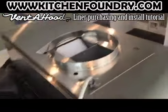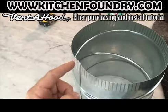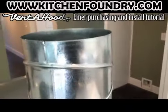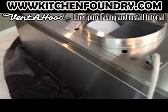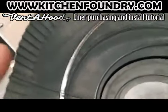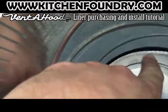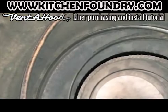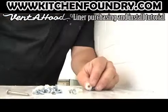After the hood's installed, one thing we don't want to do is put the crimped end down, and there's a couple of reasons for that. The crimped end, because it's bent inward in a lot of cases, might interfere with the damper opening, but more importantly, the crimped end should be facing away from the exhausting air. As we take a look inside this pipe, you can see each time you stack two pipes together, you get these tiny little air pockets, and what you want is these air pockets facing away from the high velocity exhausting air. High velocity air can make its way into these little pockets and tend to make the hood sound louder.